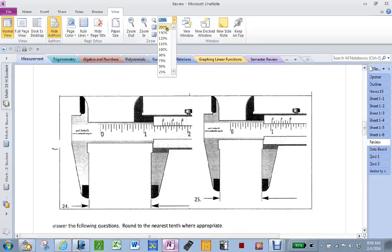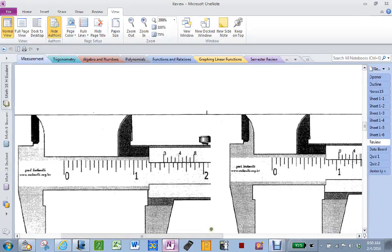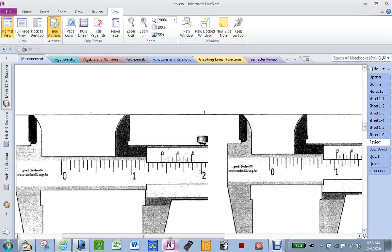Okay, now, don't just watch this again on the next one. Okay, I'm gonna zoom in so it's easier to see. So this one is not in decimals, is it? How do you know? Because it's 1, 2, 3, 4, 5, 6, 7, 8, 9. You can see that this one is all in fractions, yes? Okay, so the big numbers are divided into what? 16ths, right? And the little numbers are divided into what? Eighths. So each of these covers an eighth of a 16th.